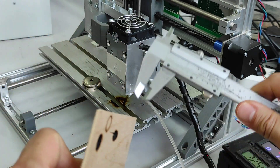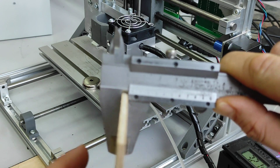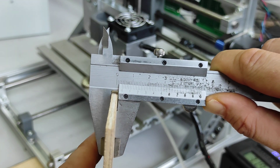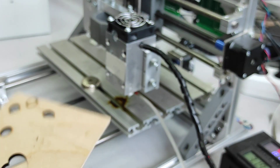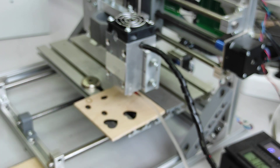Another cutting experiment — we take 3.7mm, the same density, and for this one we are going to use a little bit lower speed: let's do 75mm per minute.